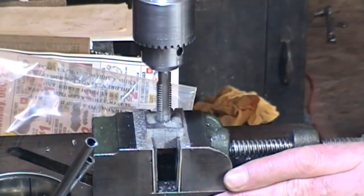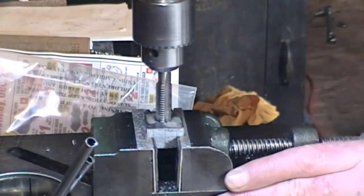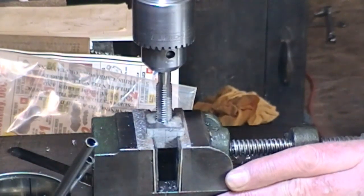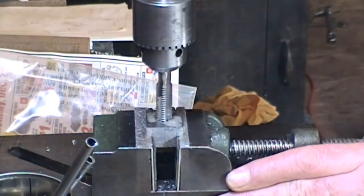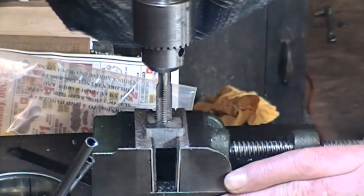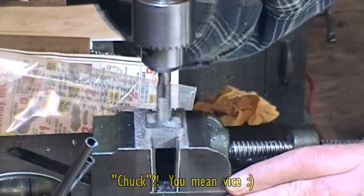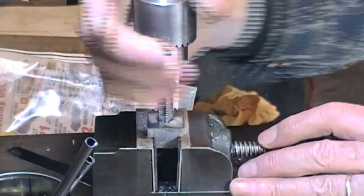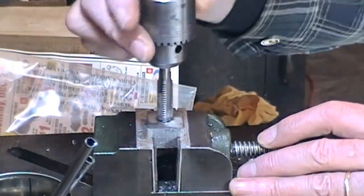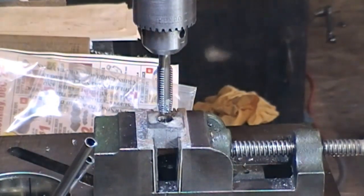The reason I go a little bit and back off, a little bit and back off, is so that the Jacobs chuck will keep a bit of a grip on it. I'm not mounting the chuck — I do some things a little bit lazy and sometimes the slow way as well. Let's just break that free. There we are — we've probably got a couple of turns started.